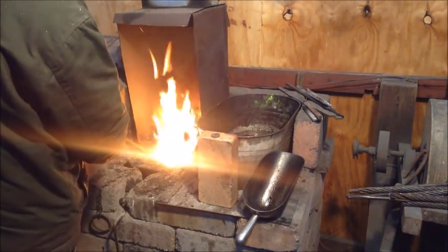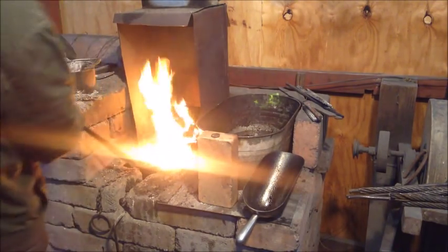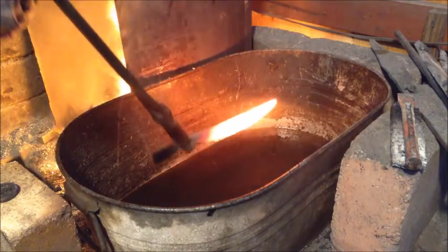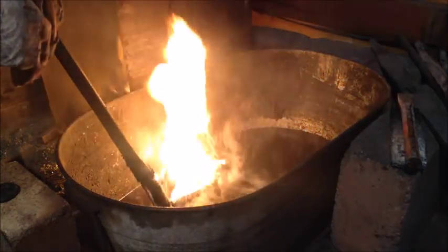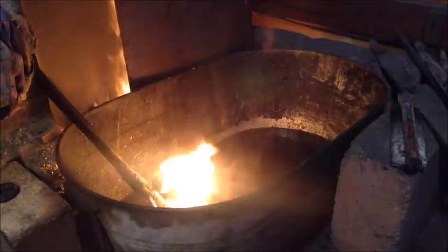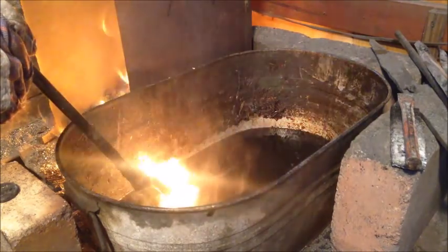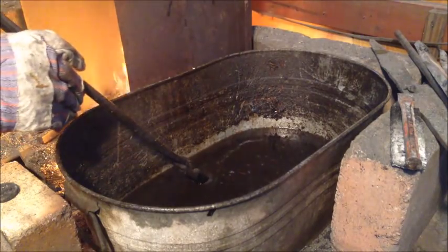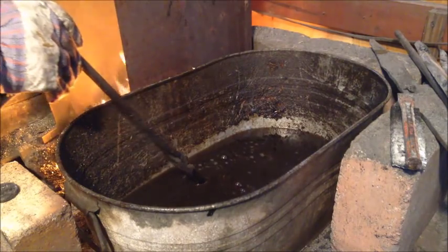This particular steel is W2. It's normally considered a water quenching steel. However, in as thin a section as I have forged it, I prefer to do oil quenching. Once it hits austenitic temperature, I go ahead and place it directly into the oil, rocking it back and forth to ensure that I'm bringing that temperature down as rapidly as possible. Once all activity is stopped, I can then go ahead and take it out. When we're doing this, we're forming that alpha martensite. But alpha martensite is too brittle for us to actually make a decent blade out of.